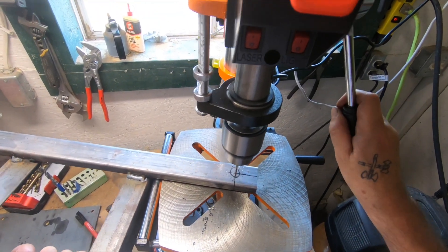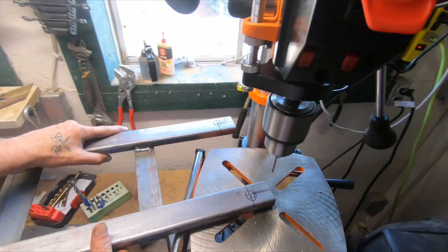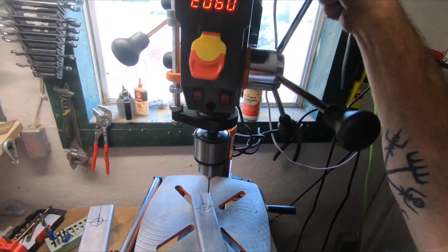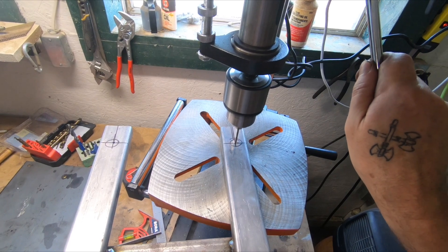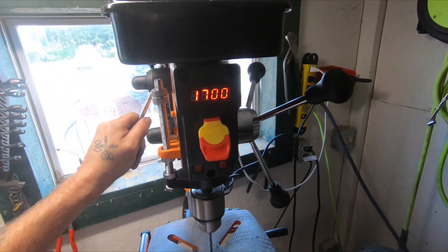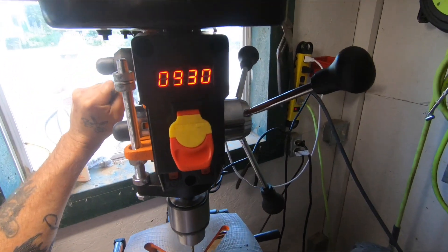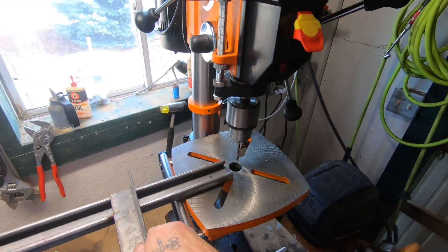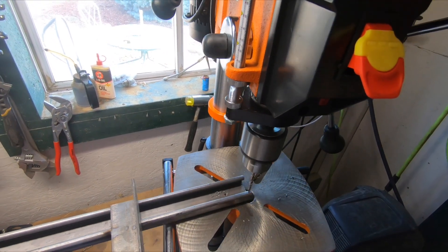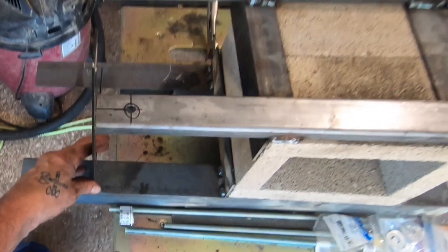Always step up with your bits — start off with an eighth inch, skip a couple bits, drill, skip a couple more bits, and keep working your way up. It's called stepping up with your drill bits. Slow down the RPMs after you get past 3/16 — I always use an eighth, sometimes 3/16. Make sure your bits are nice and sharp. You can do this with a hand drill, but use a corded one with the highest RPMs you can find, then work the trigger to lower RPMs as needed.